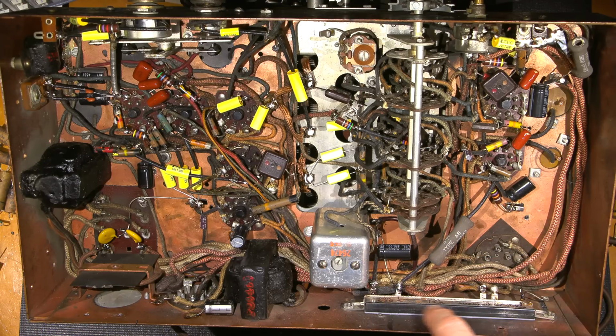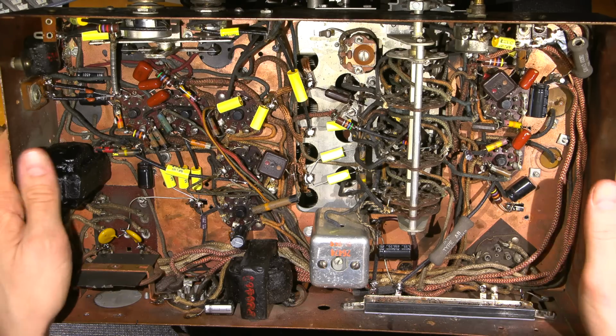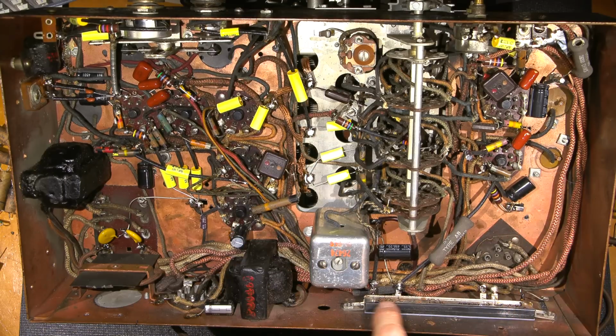Oh, this is the resistor on the back that often fails. That resistor I was telling you about that they don't give you any ratings for in the parts list or anything. So this is it here, and as you can see, it's on a bit of an angle because of the way the radio is sitting, but you can see I've actually just written down or drawn in the resistors where they go and put their values there, right on that little strip.